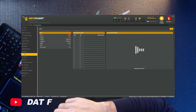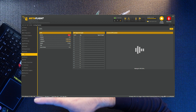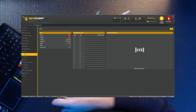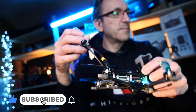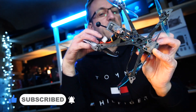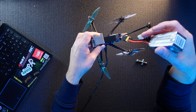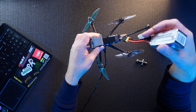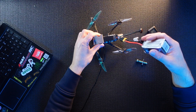So this is just a point of reference. I've got the quad connected up to Betaflight and the GPS tab up, but nothing's really going on. I know I'm indoors but it should be picking something up a little bit better than this. I think it's got something to do with the Caddx Vista and maybe those cables. This is the V2 and it has the copper covering on, so maybe something's not quite in place. I'm going to take the top off, take the Caddx Vista out and see if we get a better GPS signal even indoors.